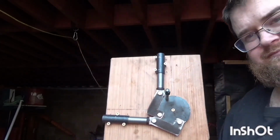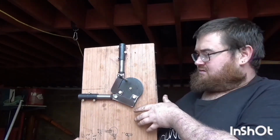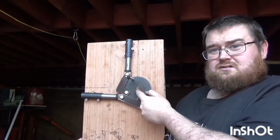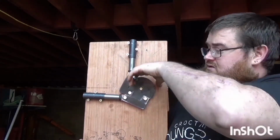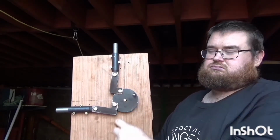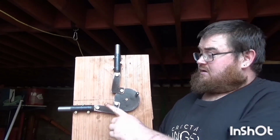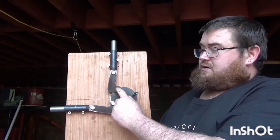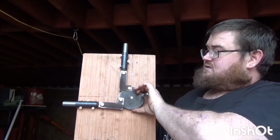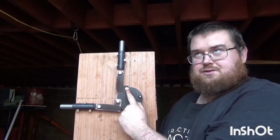So the way this works out, my centre for rotation is at 8 inches, which is measured up, and then due to the offset I put in these little, what do you call them, cam arms? Con rods? Connection rods? Now, due to the offset, I've got 1 3/4 inches of offset from this edge, which is parallel to this edge. So if I put it straight up, you've got a straight line and 1 1/4 inch, 3/4 inch until you hit the centre.